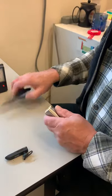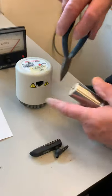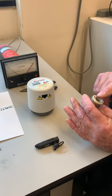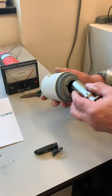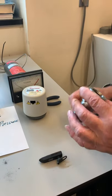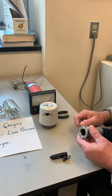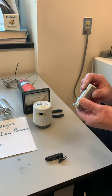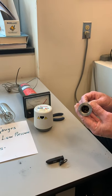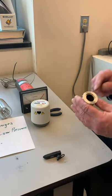What you do is place a magnet — there's a strong magnet in here — and apply a high voltage of about 3000 volts to the central pin. The combination of that magnetic field and high voltage sets off a spontaneous discharge. The discharge works by ionizing whatever gas is present, just like the ion gauge.